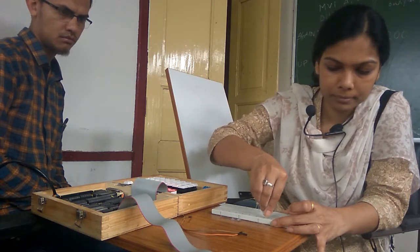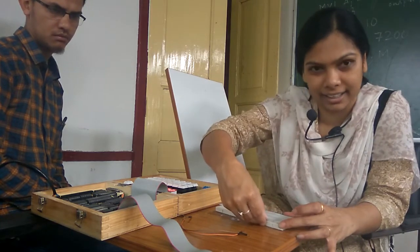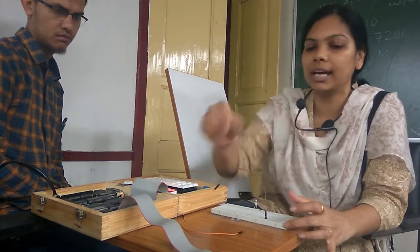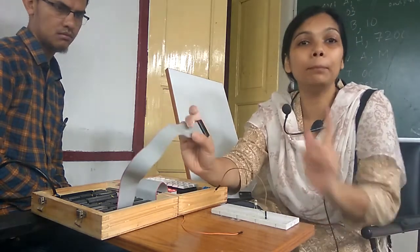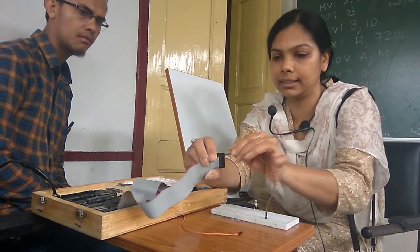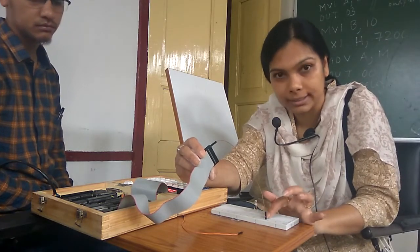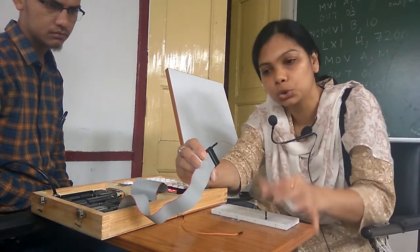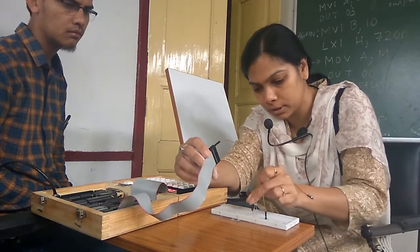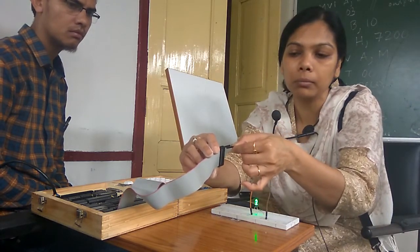Okay. Put it here. And here these are connected. So from here again I will take the value and I will connect to the VCC. This side is the VCC. Okay. So I have connected it to VCC. Right. So see, anode through a resistance connecting to VCC. And this is the cathode, the other port. So I am connecting the cathode with ground.